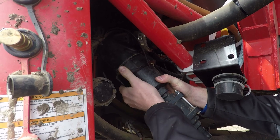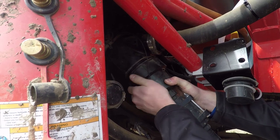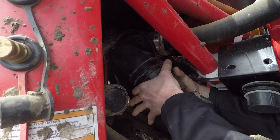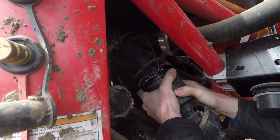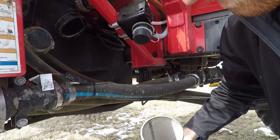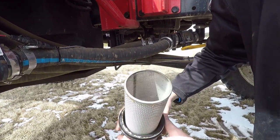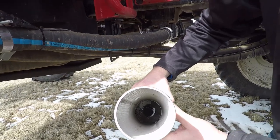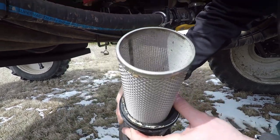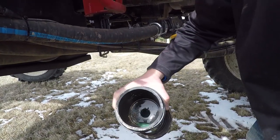Speaking of strainer, let's go through what we're looking at with the strainer on this machine. Every machine should have at least one inline strainer and it should be an 80 mesh strainer. Some have two, some have a dual inline strainer, but with Hawkeye we recommend at least one 80 mesh. Before the season, you definitely want to take it out and clean it up good. You might find rocks, buildup of chemical, or plastic parts from the tanks. The more you plug it up, the more the pump has to work and the more issues we're going to have with pressure control.